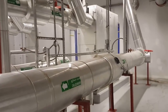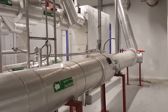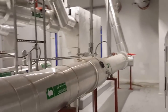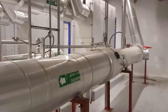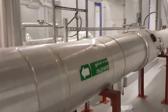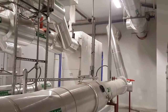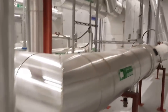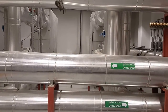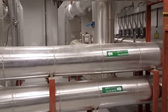This video is about heat exchanger installation details with chilled water. This is the main line for chilled water pipe — a very big pipe with cladding. The arrow shows chilled water supply and chilled water return. This main line is coming from the district cooling plant and goes to the heat exchanger, where heat is exchanged, and then goes back again.